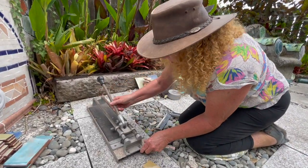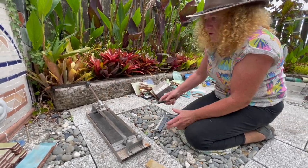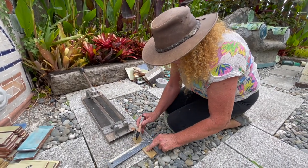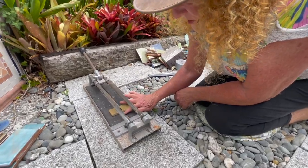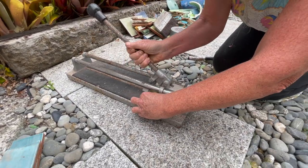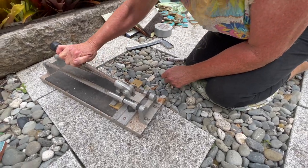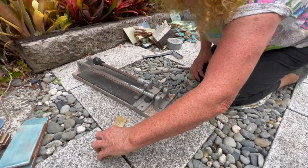This is what I call my zip zap machine. It will have a proper name. They're very cheap. I've got 3 sorts. This is what I'll be cutting. So you don't need a saw. You don't even need one of these. Very, very simple. You place that, there's a slight ridge here. You put your line on this ridge line here. Pull this over there, and then you follow through, and the pressure goes down on there, and then you get your cut there. So it's like scoring.